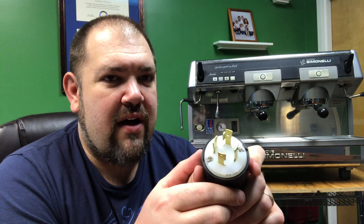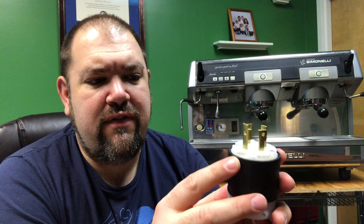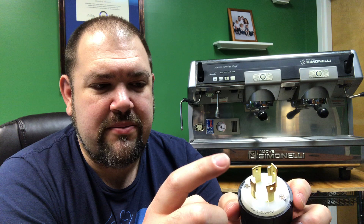So I'm wondering, because of my situation and my electrical situation, from what I've been reading, a four-prong solution is more modern. And so this is the L1430P. It is also 30 amps, and it says 125/250 volt. I think what that means is the two hots are 125, giving you a total of 250.